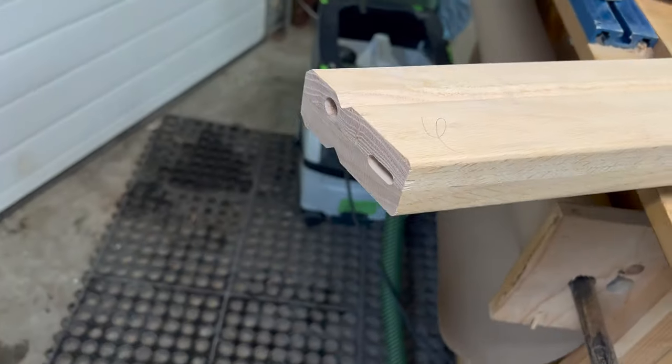I'll show you the easiest way of setting wall brackets. I've laid the railing on the stair nosings and using the framing square, it's roughly sitting on the 7-inch mark, and going up the framing square it's about 14.5 inches to the middle of the hole. So seven and a half inches down from the top of the railing is the right place to put the brackets. On the wall, I've marked my first stud — that X marks the top of the finished railing — and then seven and a half inches down on the stud is where I'll put the center of the bracket.